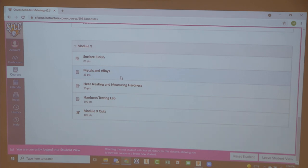Okay, so a little harder in that slot, 61. So that's your reading. Now you can do three rapid movements and three rapid measurements and take the average of the three. That portable one will do the same thing. If you hit multiple hits on it, it'll know you're trying to take an average and start averaging for you. It'll say average of 8 hits, for example. After you're done, when you pull this handle back, it's reset and ready to go.